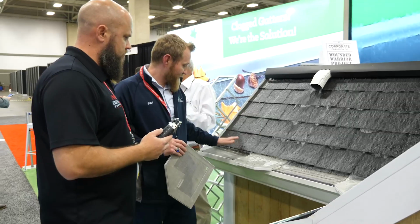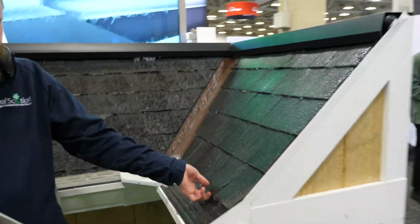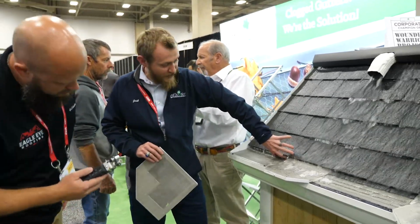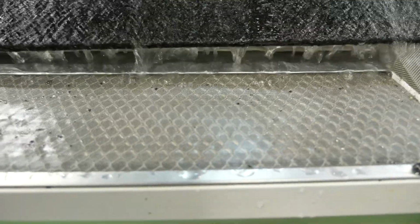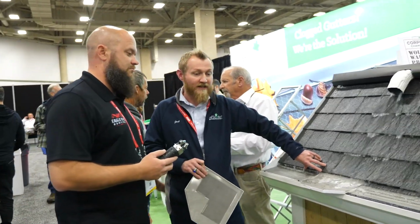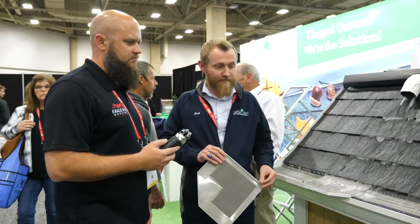All 3 products, Extreme, Leaf Solution, and New Wave, come in a flat back mount that slides under the shingles, and a fascia mount like we're demoing here on the Extreme, that gets mounted into the fascia board that actually acts as a strengthening mechanism that could allow a 200-pound man to do pull-ups on this, which you can find various videos of people doing on the internet, because it essentially puts a bracket over the entire system.